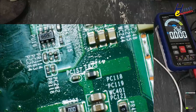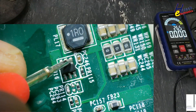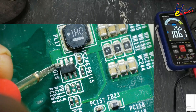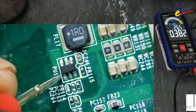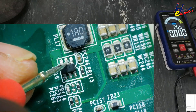The 309 switching regulator: pin 1 is ground, pin 2 is switching out, pin 3 is supply in, then bootstrap, enable, and feedback. That means there is no switching output — no bias supply for this section.